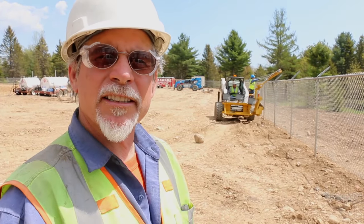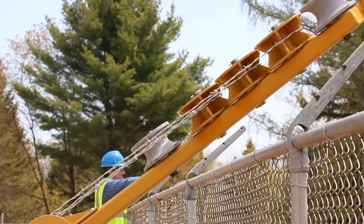As you can tell, it's pretty quick — we're running alongside at a walking speed. The guy putting the wire in the barbed arms is just struggling to keep up. As fast as he can go, we can get all three strands of barbed wire up at the same time. It just comes down to time at the end where you've got to stretch it in and fine-tune it.